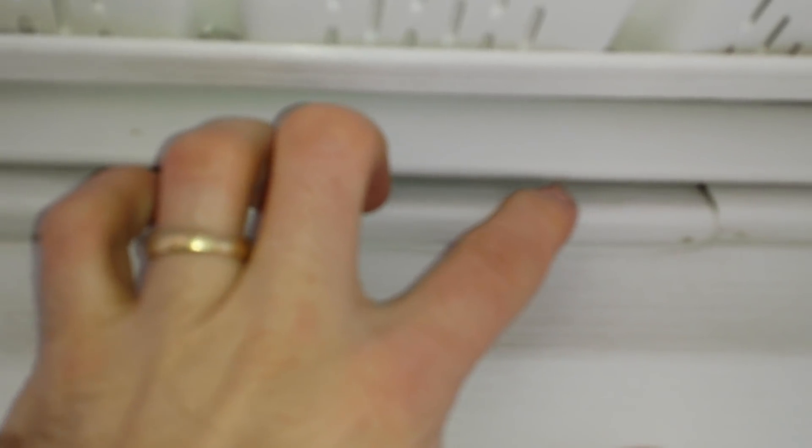There's a siding tip: if you've run out of a piece and it's only like an inch long at the end, cut a little piece - just the bottom hook - and nail it in with finishing nails. White finishing nails. This is a T4 vented soffit, that's how it looks. If you want to use a saw you'll have perfect straight cuts and it won't take as long, but you might chew up a few pieces.